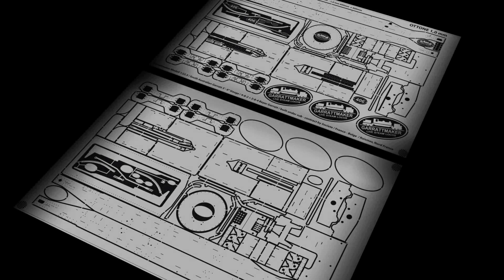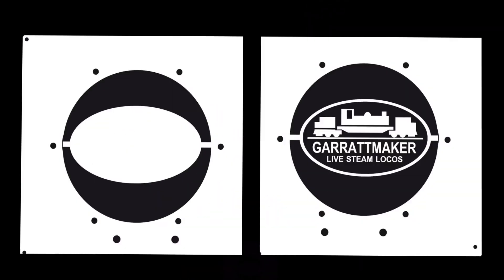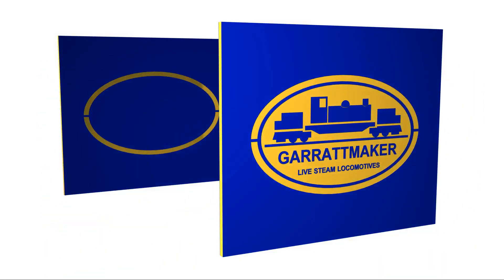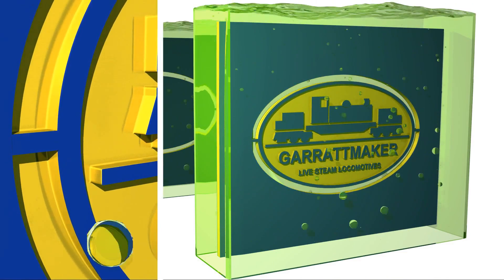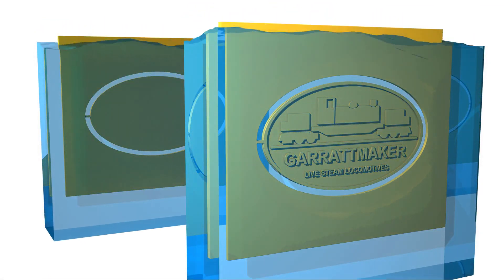All sheet metal parts are sorted by sheet thickness and arranged on a board. Differences in the front and back make it possible to add edge reliefs or fold lines. The brass sheet is provided with a photosensitive polymer. A drawing of each side is exposed and the exposed part washed out. The acid etches away the unprotected brass surfaces. Finally, the protective varnish is washed off.